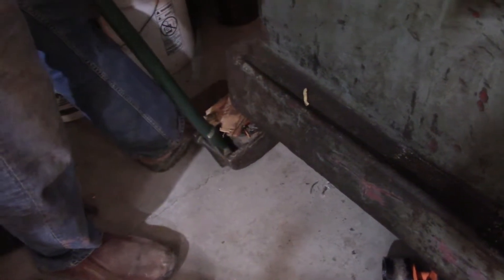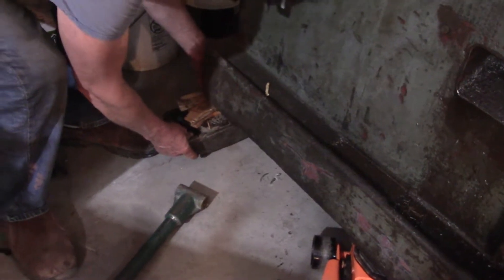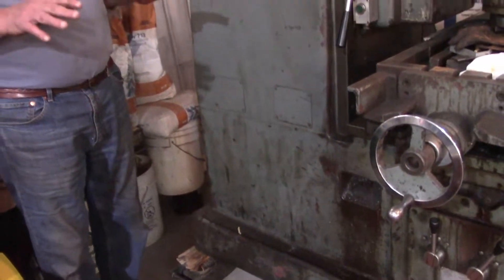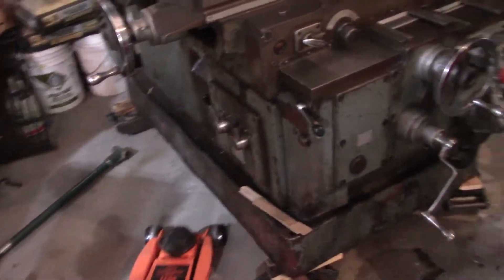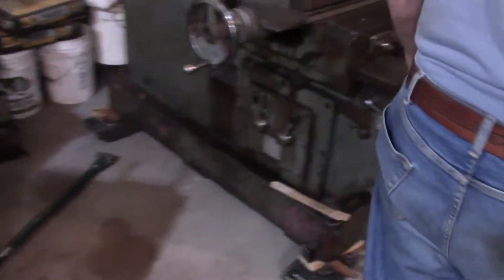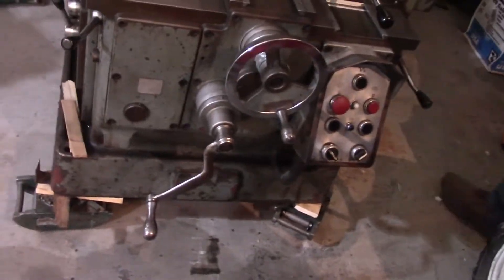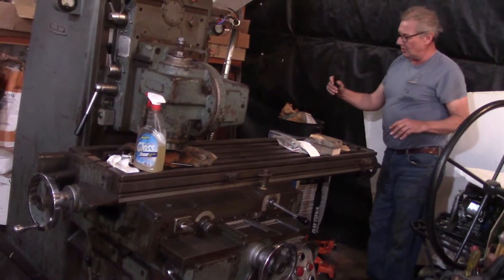What's the reason for the wood? Because the concrete was flexing due to the weight, and we kept coming unlevel — we had to keep shimming these to adjust for height because there's so much weight. If you've got any unevenness in your floor, it's going to show up. Why wouldn't you use pieces of metal? You could, but wood tends to embed better, hold better, and doesn't slide. Steel on steel will slide. So if I put steel under these and it gets bound up, I could dump the press — 9,000 pounds moving around uncontrolled is bad business.